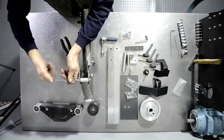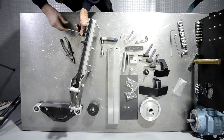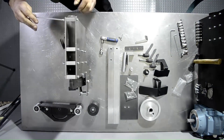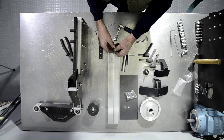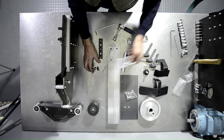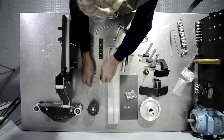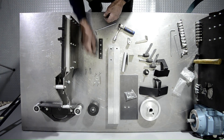Install the bracket to the bench, then the ratchet handle bracket. There's a bag with odd-size screws: three M6x30 flat head screws for the ratchet handle bracket, one M8 washer for the platen ratchet, two M6 flush mount screws for the work rest and the spring loading pin, and two M6x10 screws for the belt guards.